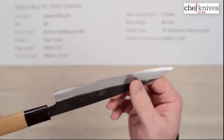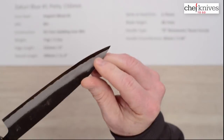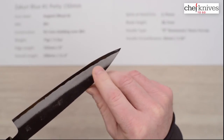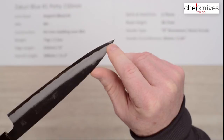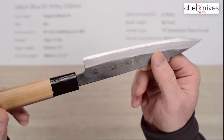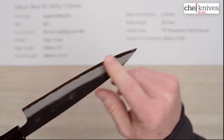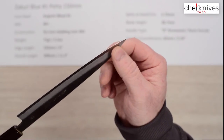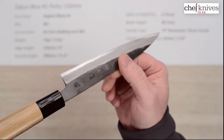At this price point you sometimes see some anomalies in the grind — not that unusual with a lower price point knife. Here we've got what's known as an overgrind, where the steel is ground down further into the blade road. It's not a bump, it's a depression — that's an overgrind. If it were a bump we'd call it an undergrind. You can sometimes get that when you flatten the blade road or do thinning — you'll have to either leave it or thin past it. This one's not too bad; sometimes if they're really bad they can affect the edge itself. You might see minor anomalies like that in lower-priced handmade knives versus the more expensive ones — they spend more time on the grind on those.